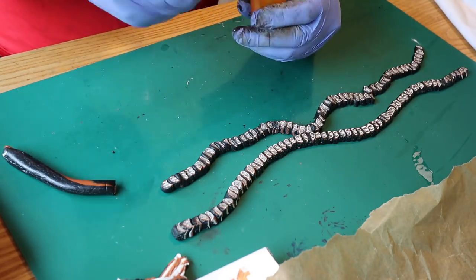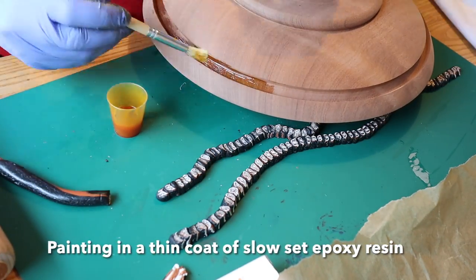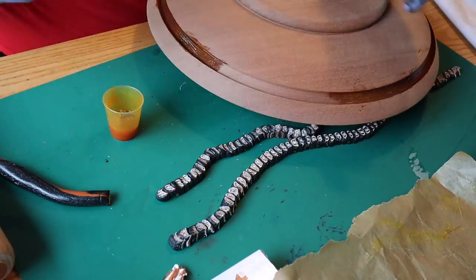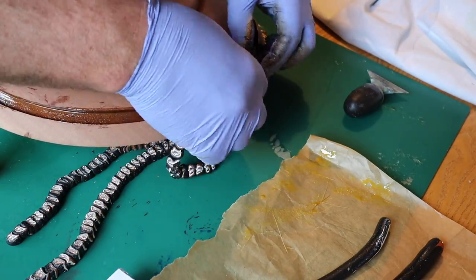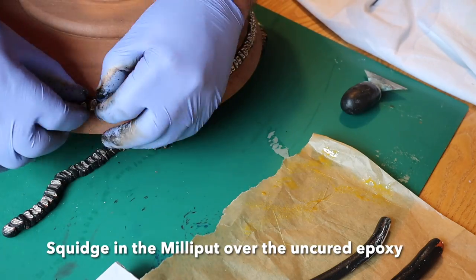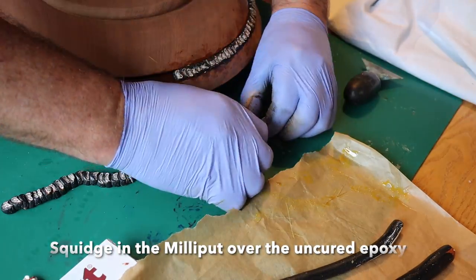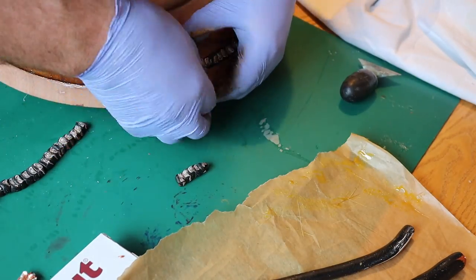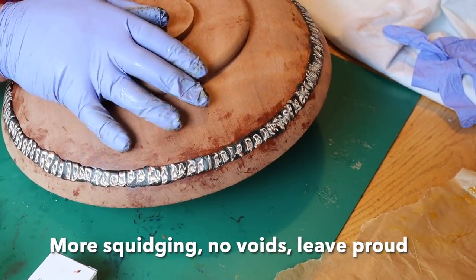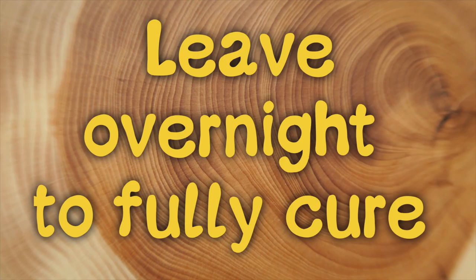So this took a bit of time. The next thing I do, which is something I don't often do, is I line the recess with some epoxy resin — slow set epoxy resin that takes several hours to fully cure. I only do this really if it's a particularly wide inlay, or an inlay that is going right through from one side to the other. Just gives it a bit more security — I know the bowl is not going to fly to pieces when I turn it. Here I'm placing that ribbon of milliput into the recess, trying to avoid getting voids, just seating it all the way round, pressing it in and making sure you get rid of all the voids. It'll start to look a bit messy, but don't worry — it all looks good in the end.